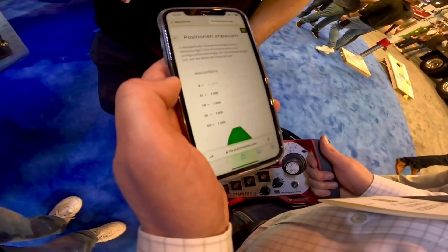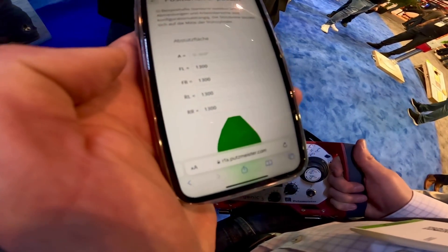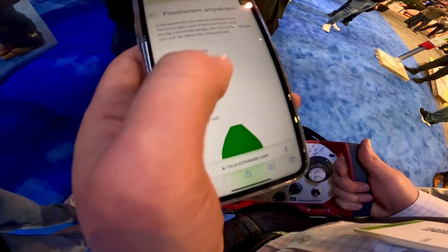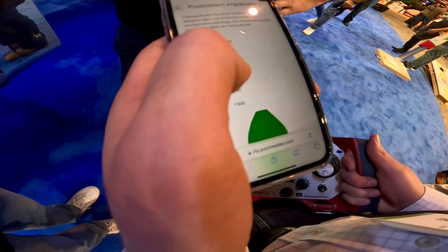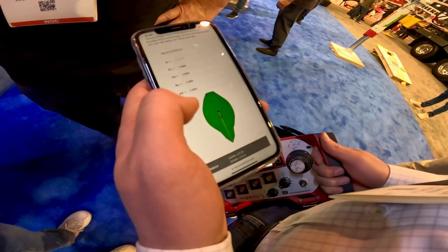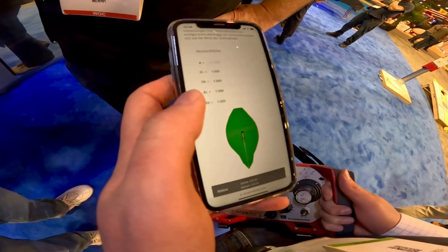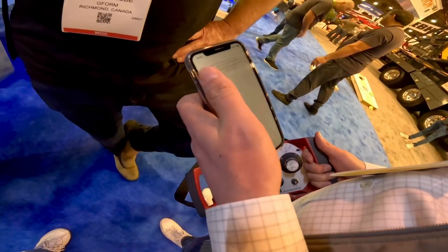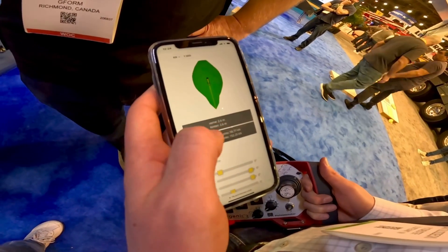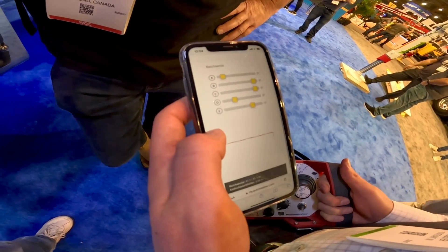In the Reach Forecast App, when planning your job you enter the space you have available. You enter the spread - the width you have - you can see the extensions: front left, front right, rear left, and so on. That's where you put how far your outriggers are going to extend. With that information it shows you the working range, and it also gives you the actual forces on the outriggers.